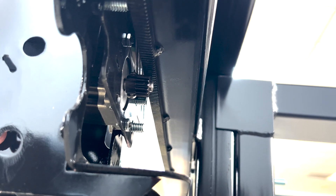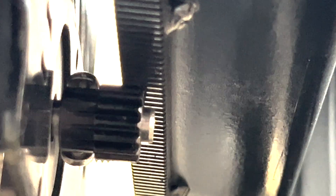The final check is to make sure that the bolts on the pinion will not make contact with the rack of the table. As long as the pinion is about halfway on and the bolts clear the rack, everything will be just fine.